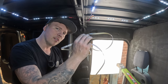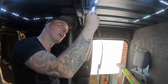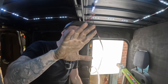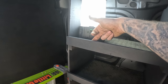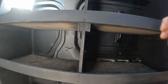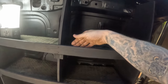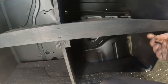Next thing I want to do is the LED tape. I've just got some off-cut of LED tape that I had, took a wago on these ones. I just want to double check that this will work. So I can do a through crimp on that, bring a cable in here down into the shelving. The plan is the LED tape is going to be glued on the underside of this rim. As much as I like to put it on the top, we've had this problem — you end up catching it putting stuff in and out and ripping it off. Put it here and it will light up. I can't really do one above here because of the lights, so it will be on this bit shining back, on that bit shining back, and we'll probably have to run one on here to shine down.